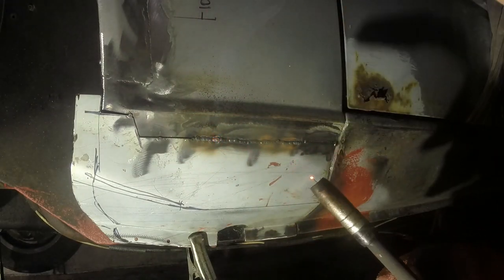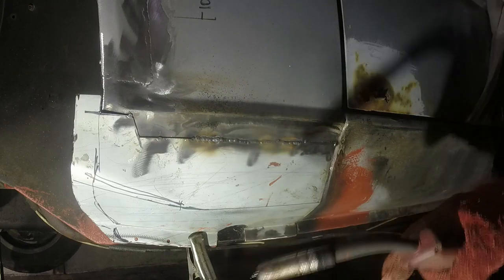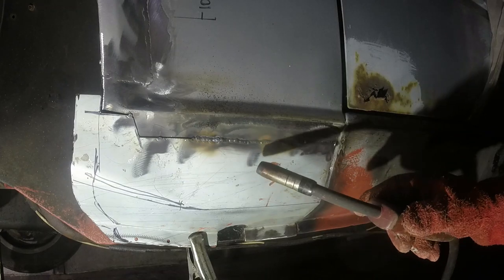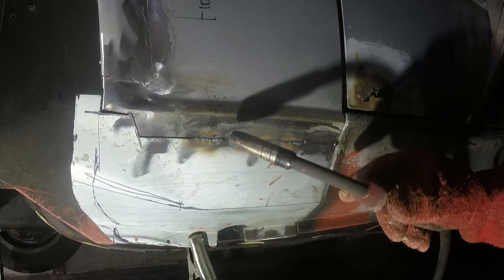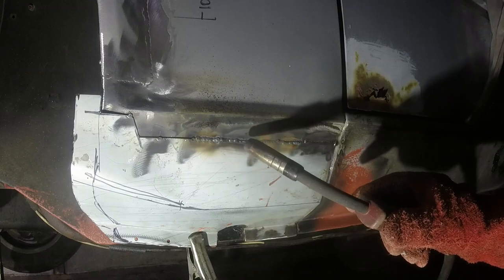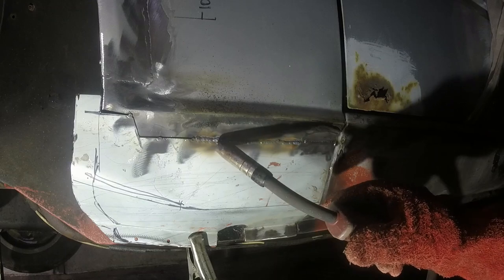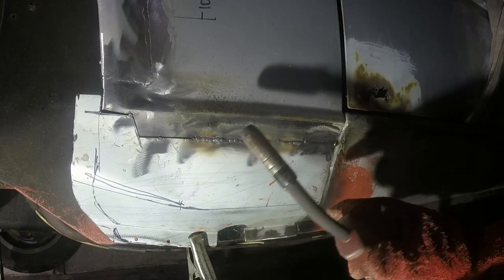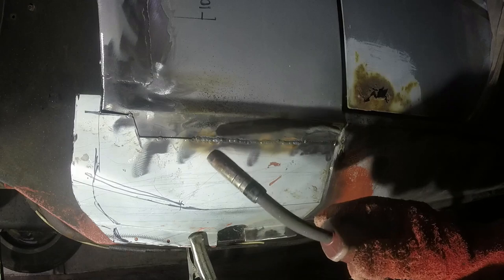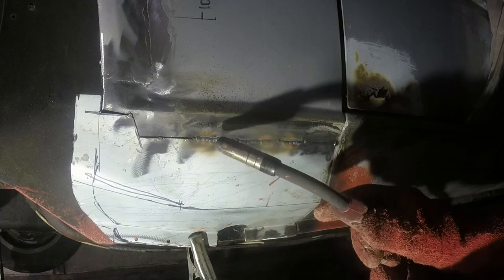That's the other thing that I've noticed I do that other people don't, and it's against everything that people tell you. You're supposed to weld that way, pushing the shielding gas onto the bit you're going to weld next to. But that really only seems to apply if you're doing seam welding on big pieces of metal. This kind of on-off welding, where I'm attempting to build up a seam, is really making little stitches, with all of this metal heated at the same time. But I bet if you cut through that with a grinder lengthways, all of that would be sort of homogeneous. There wouldn't be any voids, cold bits, hot bits, whatever. It should be okay.